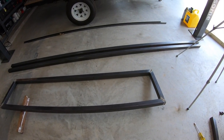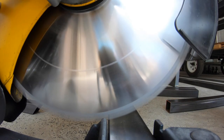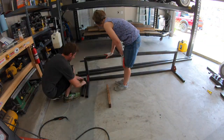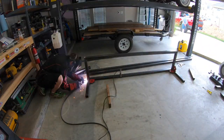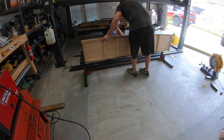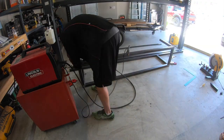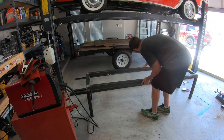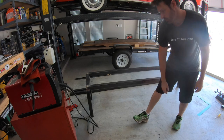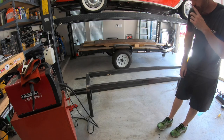The top's all welded up. It's a little messy because there were some gaps in the corners, but we filled them in and it should grind down nicely. Next up: legs. This thing is going to be 20 inches tall, so we need 18-inch legs, and luckily our helper arrived. We'll measure down where we want our shelf — 7 inches off the floor — and that gives us 9 inches of shelf space. We'll put some bars in there and then we will be getting really close to done.